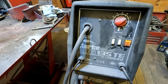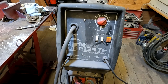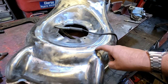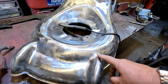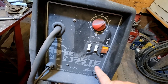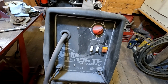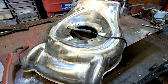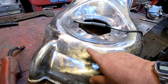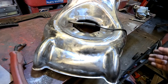This is my little setup I've got here — it's a Clark Weld MIG 135TE Turbo. This is ideal for small bodywork stuff, car bodywork and stuff like that. This is actually thicker than car bodywork — this is probably 1.25mm. Car bodywork is normally one millimetre, which is 20 gauge. For this setup I'm just going to have it on number one, minimum power, and I'm going to have the wire speed set between six and seven. I find that to be about right for this sort of application. I'm going to put you on a tripod now — I'm ready to go, just going to try and dab some weld on there. They will probably blow a bit wider and bigger, but I'll have to ride the back of the weld and just fill them up, then we'll grind them down afterwards. Then we can powder coat it.